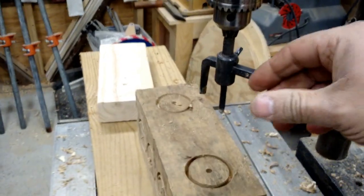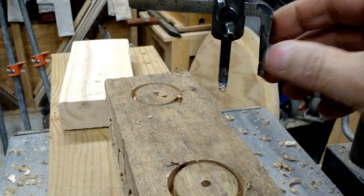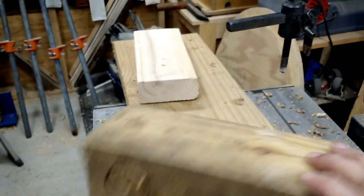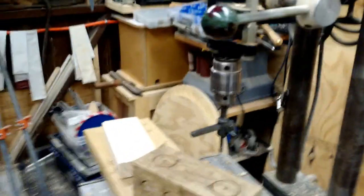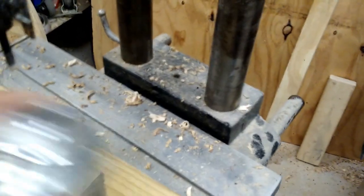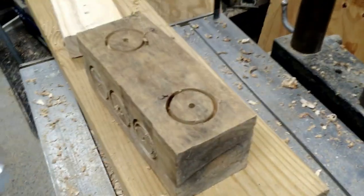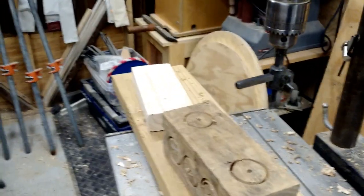What I have here is actually a circle cutting bit for tile. You might be able to make out that this is carbide tipped. On a whim I said, let me see if this will work in wood — and guess what, it does. The reason I'm doing this is because I need to make a hole. You can see a couple of test holes. I need to make a hole in my tailstock assembly to accept my live center hub. This is just about the right size; I want that to go in there relatively snugly. And that hole — because it's wood — it's tight in one direction and kind of loose in the other, but I think that'll be a tap-in fit. So I'm going to go ahead and set this down and let you watch how it drills.